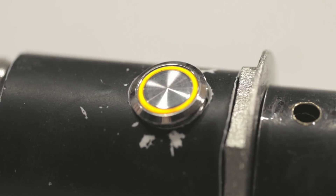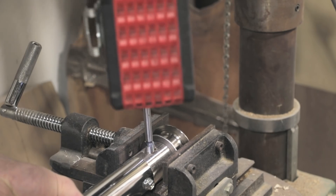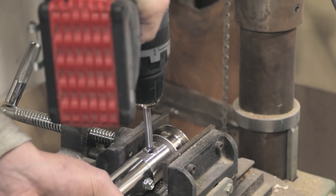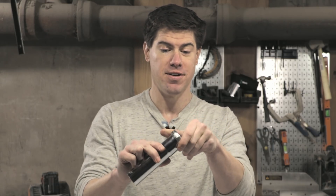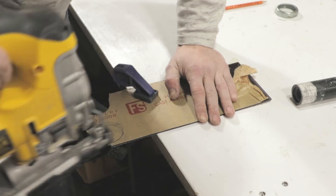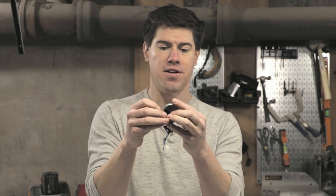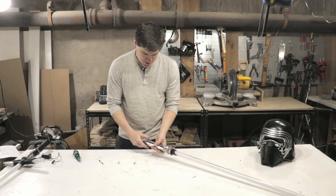To really make this look like a high-end saber, we're going to use an LED push button to turn the saber on and switch modes. The LED button is threaded and has a nut, so we'll just need to drill a 5/8 inch hole in the hilt to make room for it. To make the bottom cap for the lightsaber, we're going to use the slip ring that came with the extension tube and screws onto it. The slip ring is hollow, so I cut a circle from a piece of acrylic with a jigsaw to fit inside the slip ring, giving us a screw-on cap for the bottom of the hilt that lets us access and change the batteries.